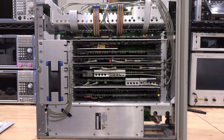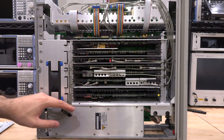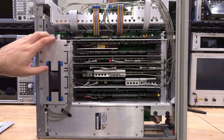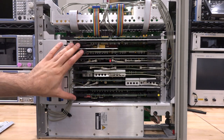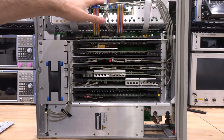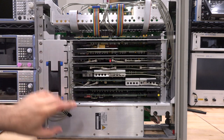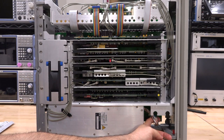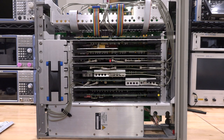Here's what's inside of the unit from the top. I already took off a cover that was blocking this area. Multiple boards in there, as is classic design from HP. The big motherboard in the back connects everything together. Synthesizers and various analog and digital stuff is all over here. A lot of the RF stuff is there as you can see from the piping at the top of this unit, and this fan blows across its entire section. Here's the power supply.